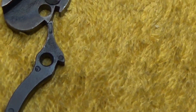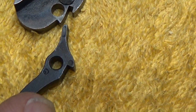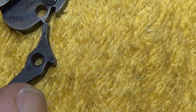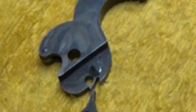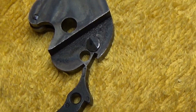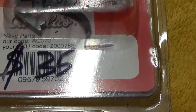The first idea we had was that the sear was just a little bit long, and if we shortened it up just a tad it would drop into that notch like it belongs. So we got out our stones and jigs and all that good stuff and worked on that trigger. I think we had it in and out of the gun ten times, maybe more, taking off a few strokes each time. And absolutely nothing changed.